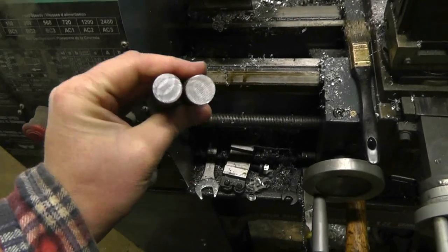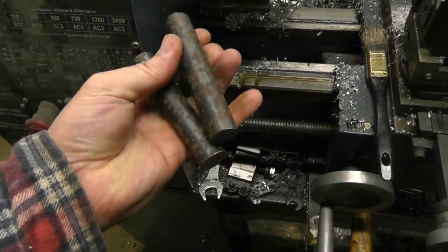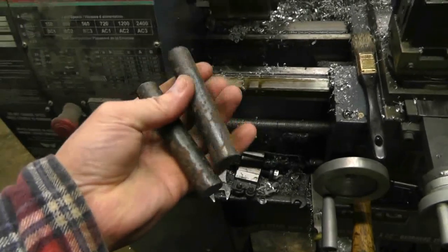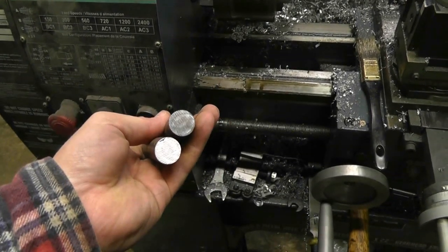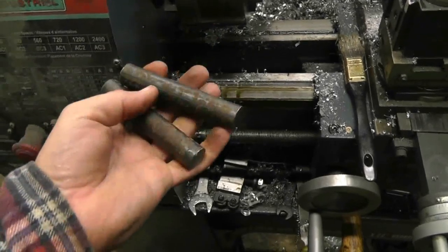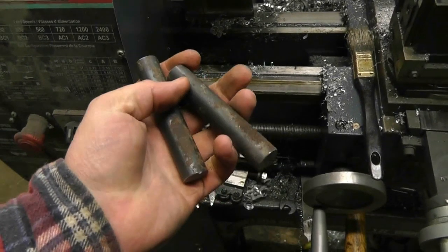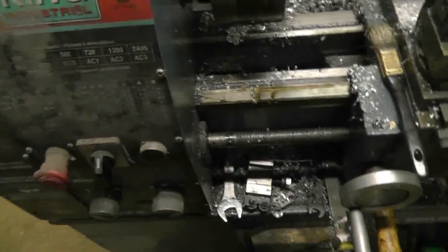So here's where I'm going to start out. I've cut two 4-inch long pieces of 3/4-inch round stock. I'm not sure if this is hot rolled or just cold rolled that has rusted pretty bad, but it's going to get turned down by about 50 thousandths to about 0.7 of an inch. First thing I'll do is face off each end and center drill it. Actually, I'll face off one end, center drill it, pull the item out of the chuck and support it with a live center, then turn the outer diameter, part it off, flip it around, face the other end, and center drill that. Then we'll be ready to go — I'm going to do both of them in a row.